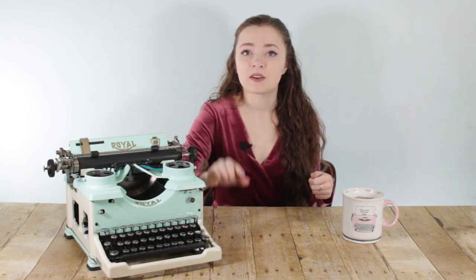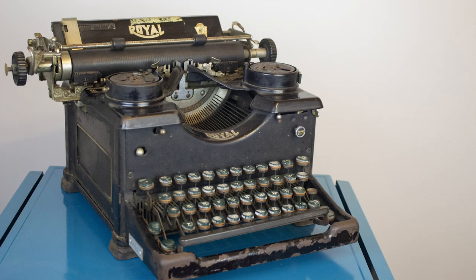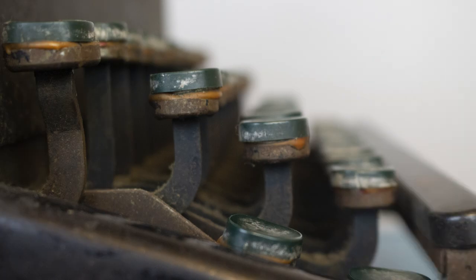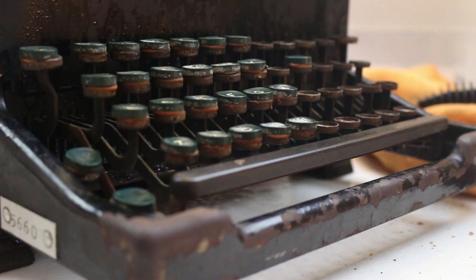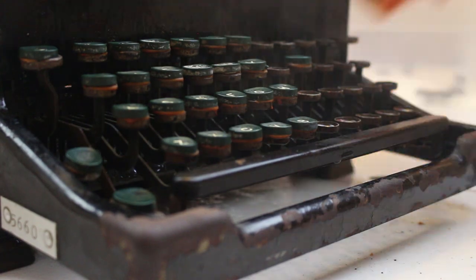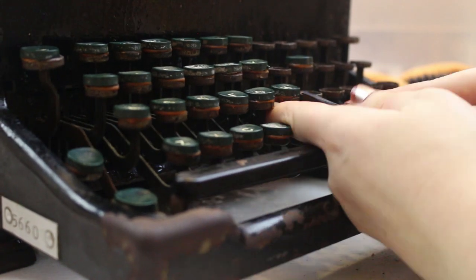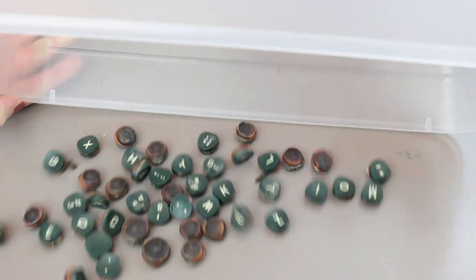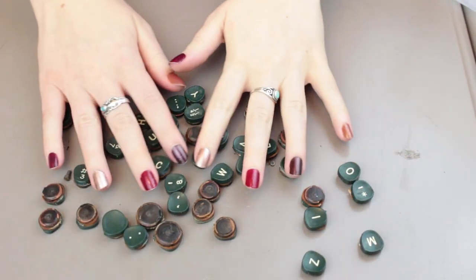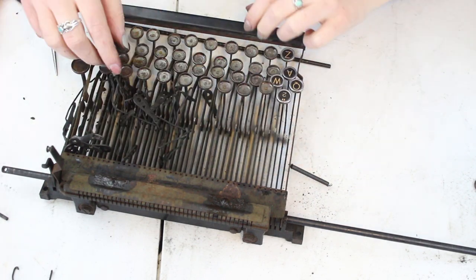In about January of 2021, I decided to tackle the most intimidating part to me, which was actually the keys of this typewriter. They were these green plastic things that you would usually see on a machine from the 1950s on a Royal, and I didn't know what was underneath them. So I did go through the process of steaming off those top keys. Turns out they were just plastic keys glued in with wood glue on top of the original key cup, but there was nothing underneath them, so I did have to go through and find some donor keys from a parts machine to inset into this typewriter.